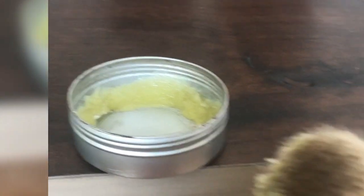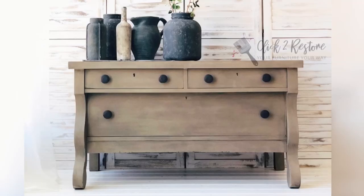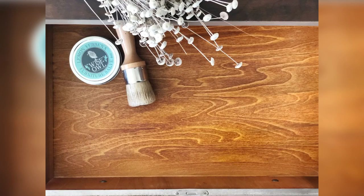For restoring — these are the insides of the drawers, and you can see they had patches all over. I wanted to restore them and give them a nice wood color look, so I used Howard's wood restorer in the lemon scent, applied it generously to the insides of the drawers, and restored them back to their original color. You can see how beautiful they looked on the inside. I also sealed this entire piece with Howard's Restor-A-Finish once the waxes were dried. And here is the final finished look — hope you enjoyed the video, thanks for watching.